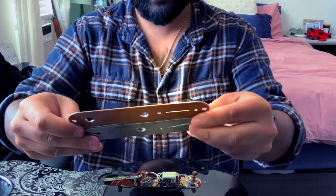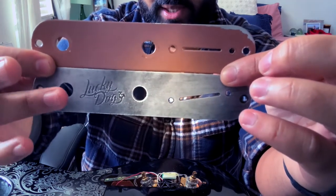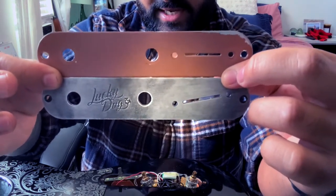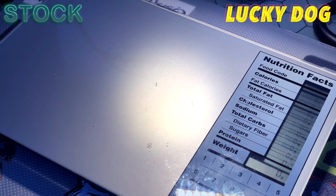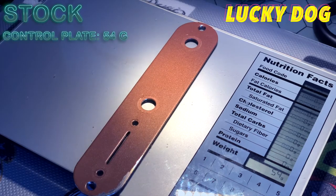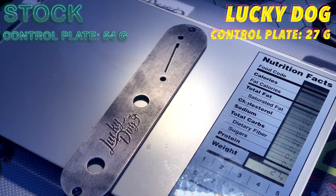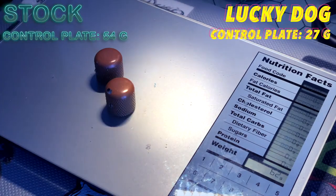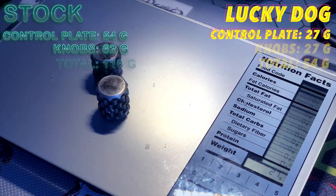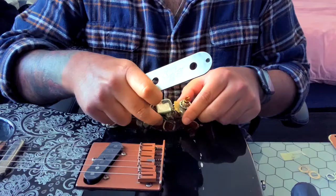So this is pretty cool — if you see these side by side, line up the mounting plate and you can see the switch panel is angled. They also made the pots a little bit closer together, which helps with manipulating the switch without hitting the knobs accidentally. While we're at it, let's throw these on the kitchen scale. The old control plate is 54 grams compared to Lucky Dog's at 27 grams. The old knobs are a solid 62 grams compared to Lucky Dog's at 27 grams — each one being about 14 grams.